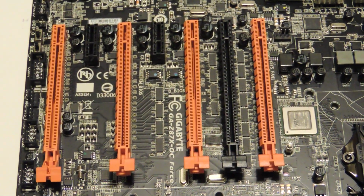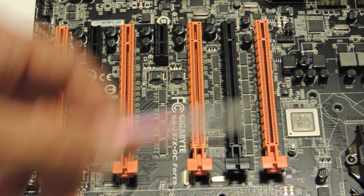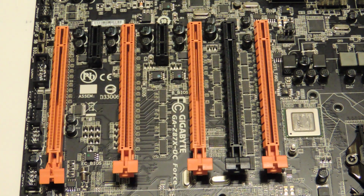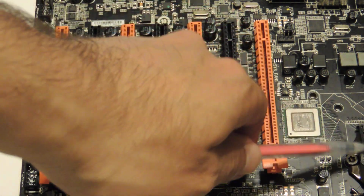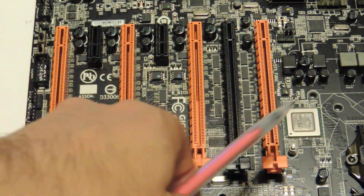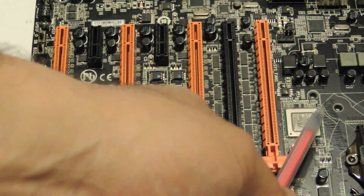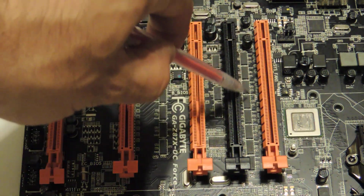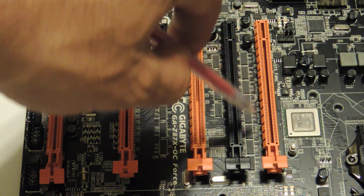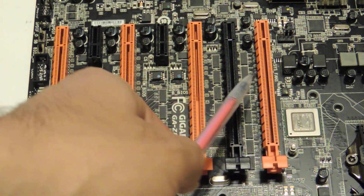Okay, so PEX 8747, 48 lane bridge chip. It's basically a big switch that takes bandwidth and shoves it wherever it needs to go. Now, it gets 16 lanes from the CPU and then 32 downside. So that's a total of 48. That's what it means when it says 48 ports. Anyways, these 8 PCIe ASM 1480 switches are all PCIe 3.0. Each of them can switch 2 lanes, so 8 of them, 16 lanes. So the CPU's PCIe goes to these chips first.